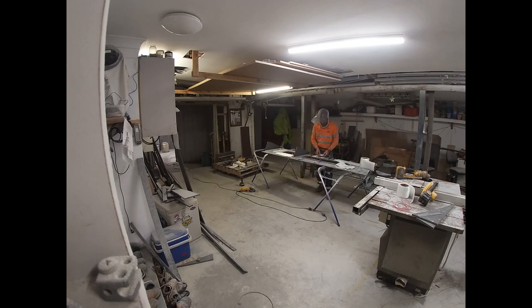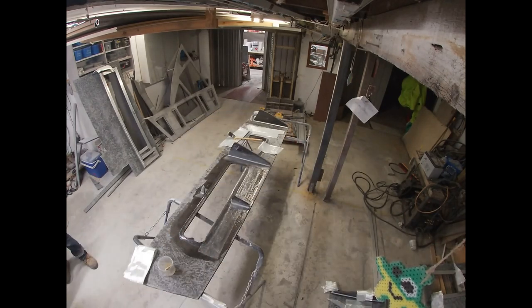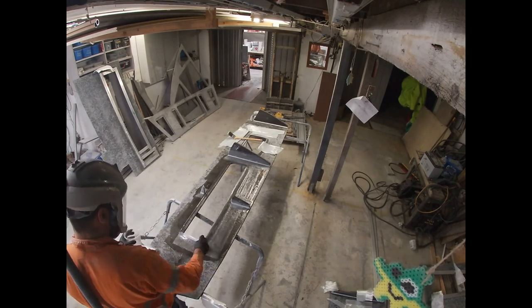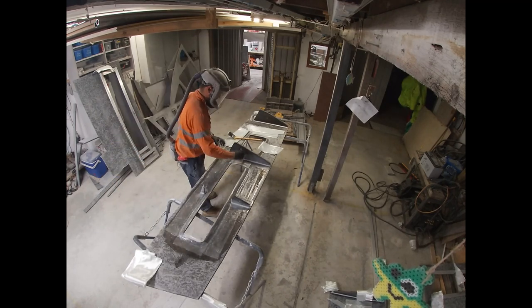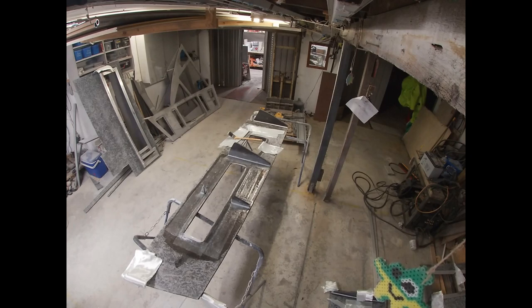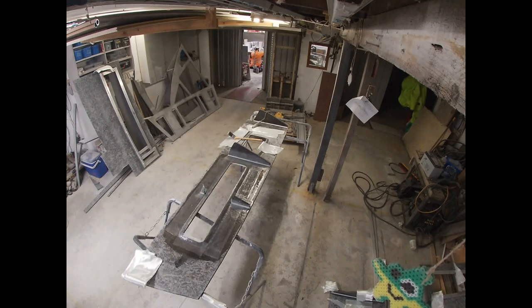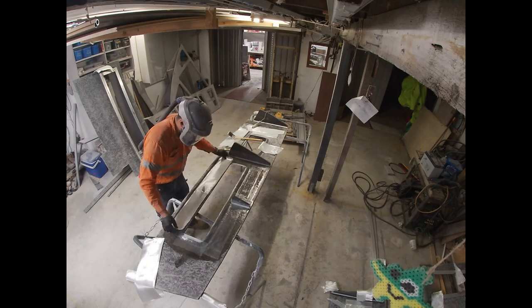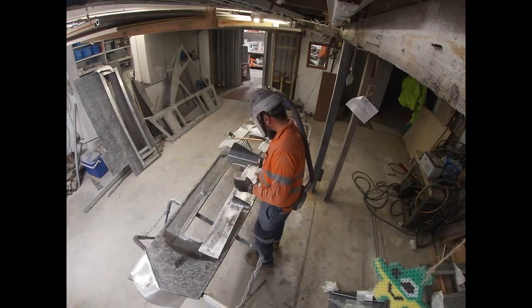Lots of fiberglassing when you don't do it the aluminium strip way, so please take note, beware. I would have done everything with aluminium if I knew how much of a pain in the ass it was going to be to do it like this, and how effective the aluminium strips were. I used epoxy resin for this as well. At least with epoxy resin you've got more time to play with it, but it is a pain in the ass to wet out compared to using polyester or vinyl ester resin.